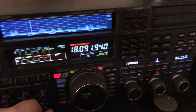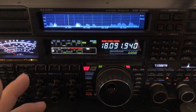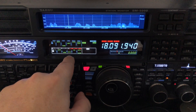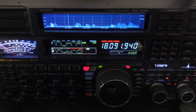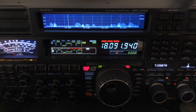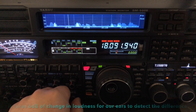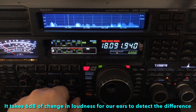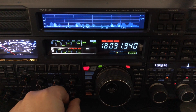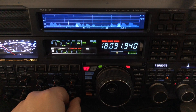I am using AMP 2, and the S meter is calibrated at AMP 1, I know. It's calibrated with AMP 1 at 14.2 megahertz. Chances are it's probably still fairly close at this frequency. But these S meters, they're not exactly the 6 dB per S unit that they were supposed to be. An S meter is supposed to reflect a change in the loudness to your ear, and it takes a 6 dB change for you to notice that difference. That's why they arrived at the 6 dB per S unit, but most radios don't adhere to that. I go by how he sounds. And listen to how clear that is.